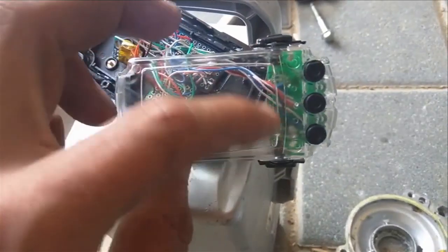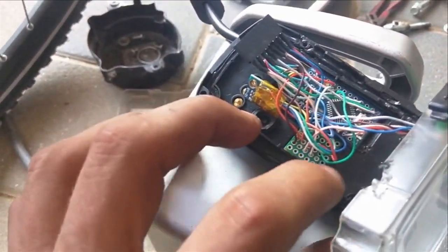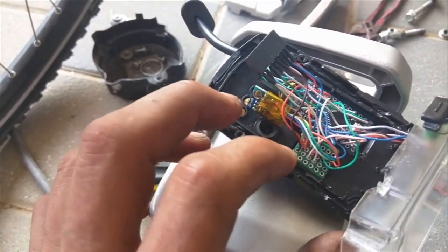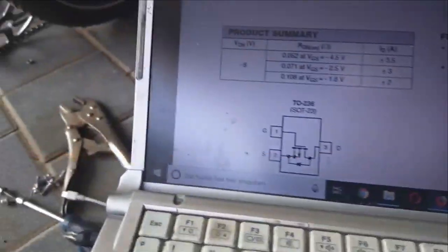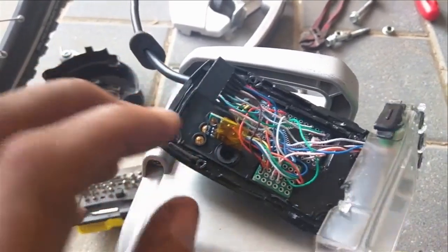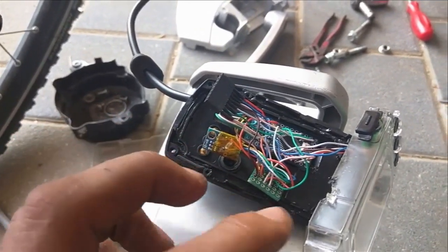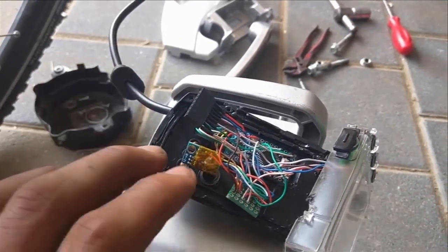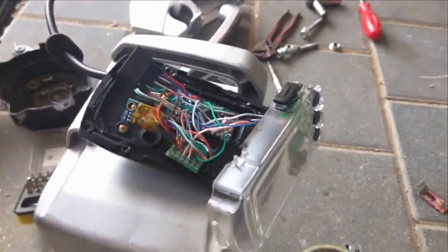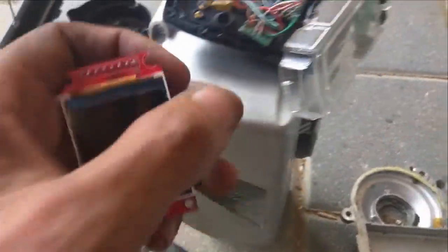I saw-cut it apart, and all these switches go to the Arduino Mini. There's a 6x6 mini prototype board with a P-channel MOSFET underneath to get the display on. There's an 1.8 inch display and an HTU temperature/humidity sensor. I needed some pull-up resistors so I simply used this one. So the display is a bit modified here so it fits.